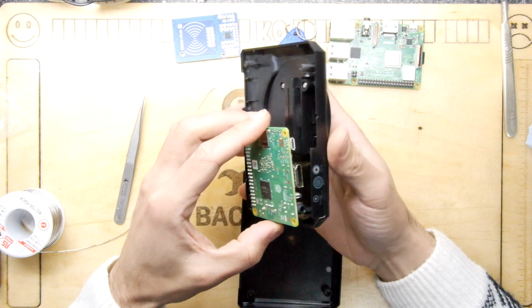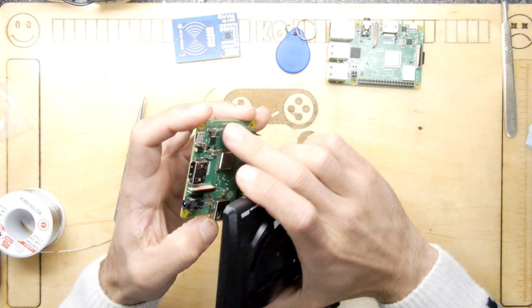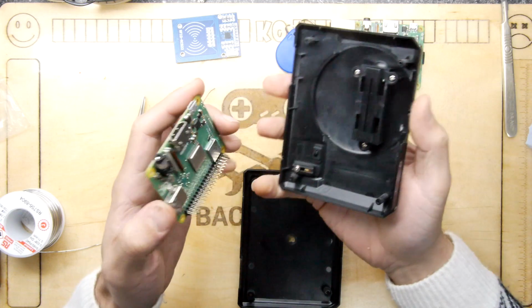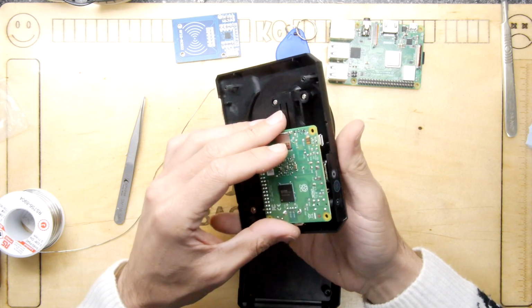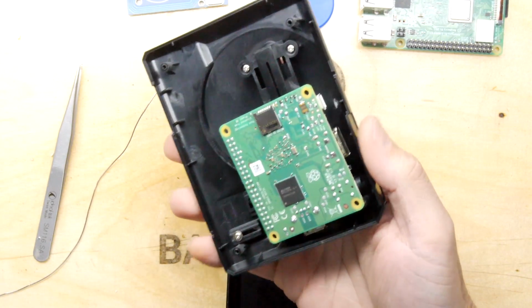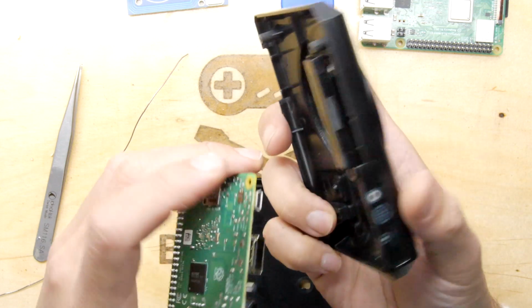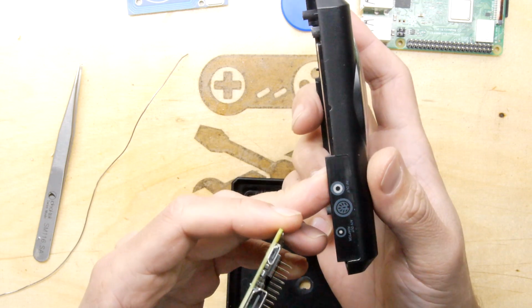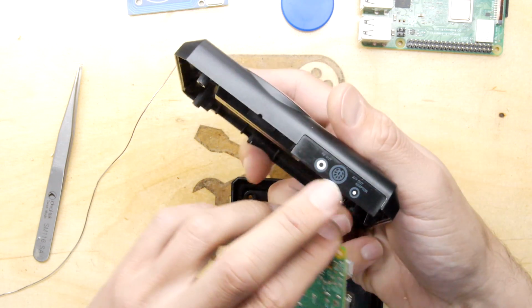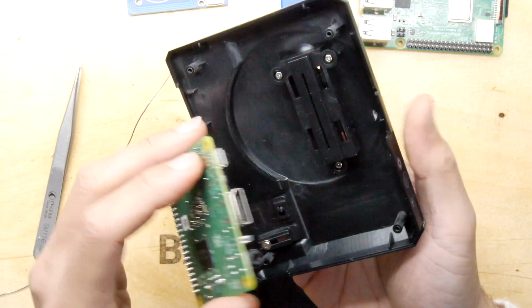I think I'm going to settle for putting it in this way. So I've removed that LVDS header, and you've got to be careful. There are some wireless components here you might nom. Try not to. And in order to do that, I think what I'm going to try doing now, I'm going to do some whittling before I take this panel out, to sort of cut it out, which is kind of irrecoverable, which is kind of a shame because it says RF out and it's got all the markings, but at some point we need wires to be able to get into this damn thing.